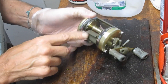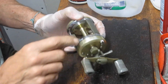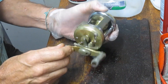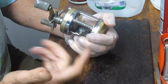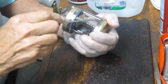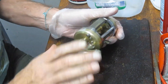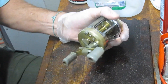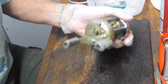The free spool release button is stuck in a downward mode, which would mean it should free spool, but unfortunately it's quite the opposite — it didn't release. We've got a line guide that's missing, which probably if this went overboard, that's a problem before it even went overboard. The track inside here kind of suggests that maybe that's what it was. So I paid $5 for this. What was I thinking? I don't know. We'll find out as we go along.